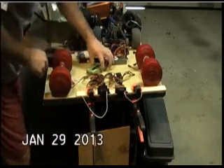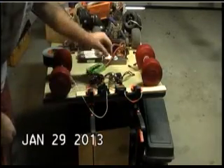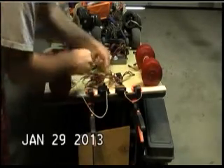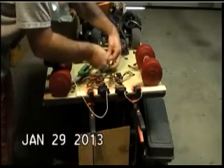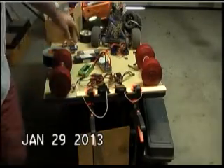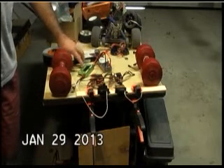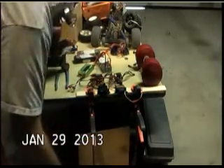Right now it's registering 8.4 volts and no watts. I'm going to turn on the Solar servo first, but I notice I don't have the high voltage input hooked up, so I'll go ahead and plug that in. A natural draw without any movement on the Solar servo is 0.1 amps, or 0.8 watts. Now I'm going to put a load on it.